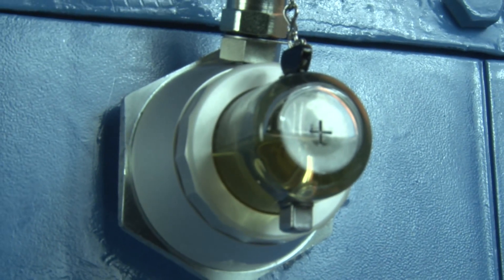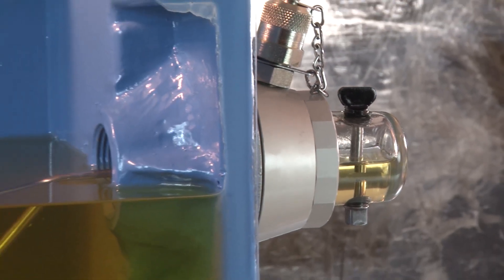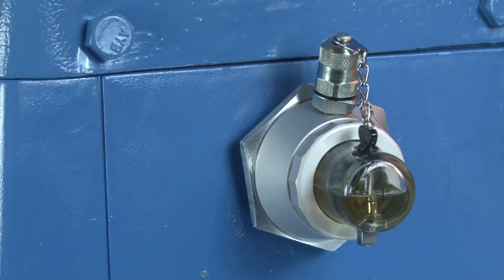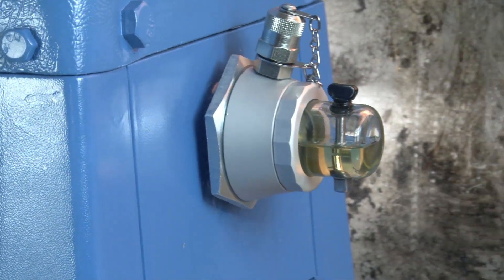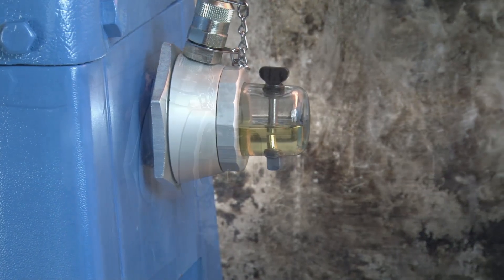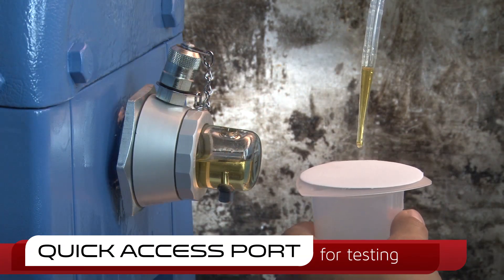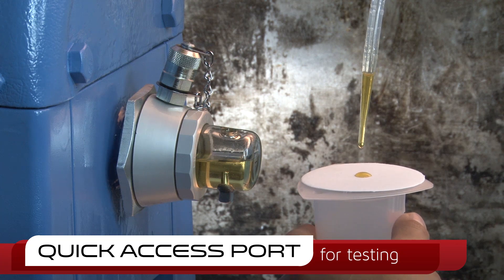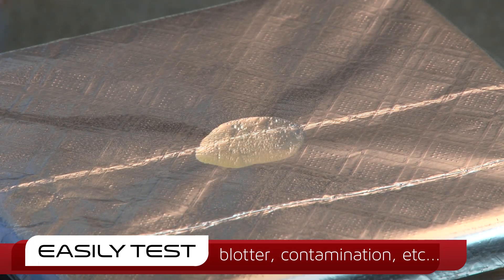The new Condition Monitoring Pot, or CMP, is a multi-parameter inspection device that modernizes and expands the power of daily one-minute inspections. In contrast to standard bullseye gauges, this revolutionary inspection tool does so much more than just confirm oil levels. An easy access testing port allows quick sampling for a variety of handheld instrument tests, including blotter spot, crackle tests, and more.